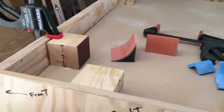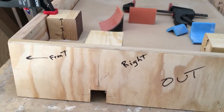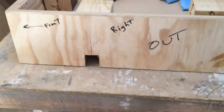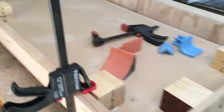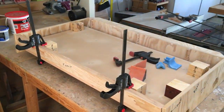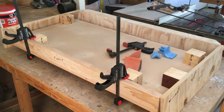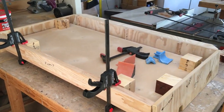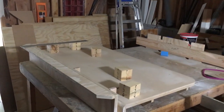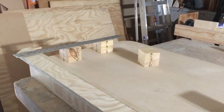Reviewing my progress, I am showing most of the components including some 3-inch spacer blocks that I will use to make sure all four sides are at the same height. Also shown here are two orange outside forms for the corners of the countertop, and the blue parts are the sanding jigs. I found that I needed to cut some slots in the sides to accommodate clamps — on one end of the right side I cut it in the wrong spot and had to glue the plug back in place to re-cut it after the epoxy is set. Remaining parts to make are the plug for the sink, the plug for the faucet, and the upper form for the walls. Also need to make the cove for the splash. Always remember to measure twice when cutting, and then a third time after the first cut when cutting multiple pieces — trust me, it will save you headaches like this.